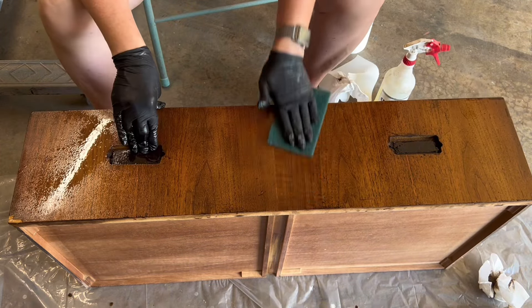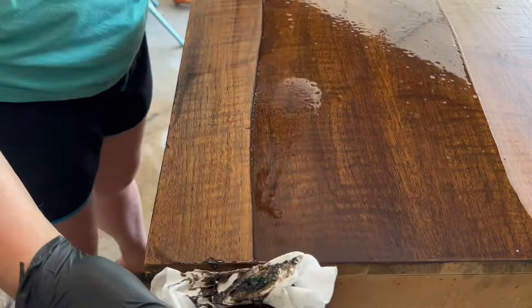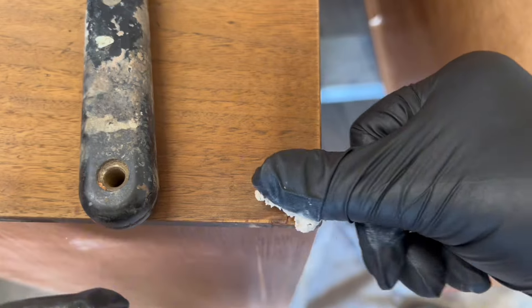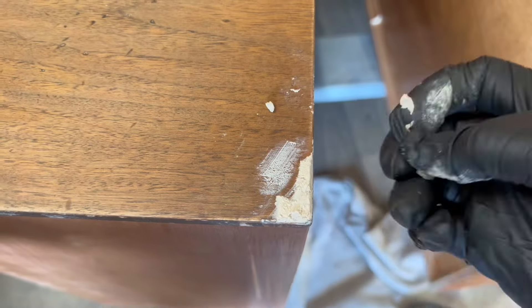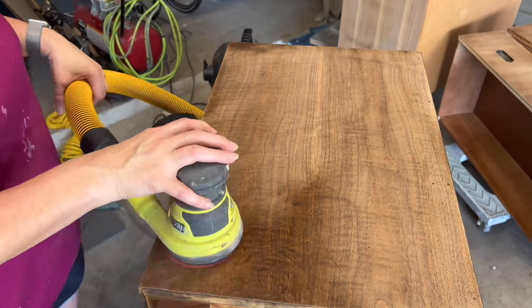Through these flips, I use lots of different strippers, but I'm really trying to go with non-toxic ones right now. Usually natural strippers, you just have to let them set a little bit longer for them to do the work. This corner was the only area I had some damage, so I'm using some Quick Wood to recreate that corner. Anytime you have a corner or a structural piece, you want to use epoxy — it's better for more structural repairs.